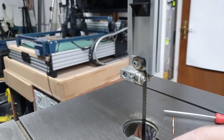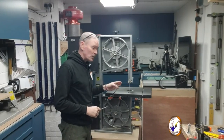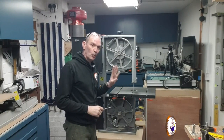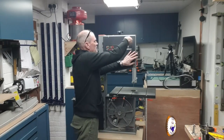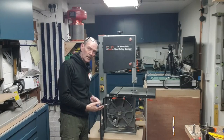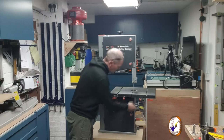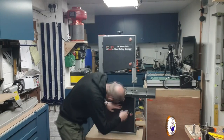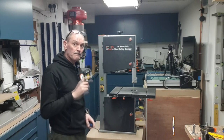Both side rollers should be turning freely and the back one should be turning without rubbing on the blade, and they should all be behind the front teeth. Once the top ones are all nipped up, do exactly the same on the bottom ones. Once top and bottom runners are all adjusted correctly, shut the doors. On the bottom door my machine has a little finger guard that has to come up as you close it. Lock the door.